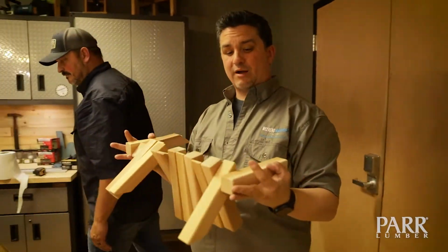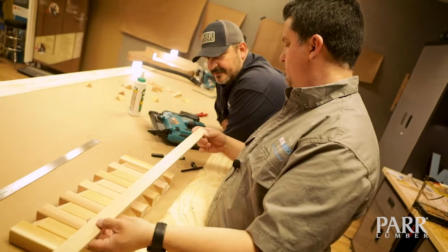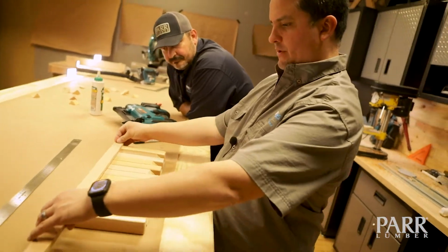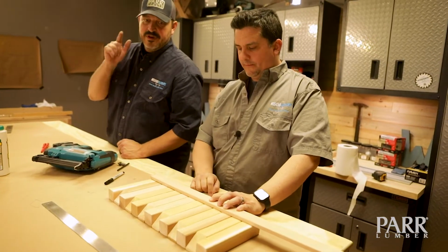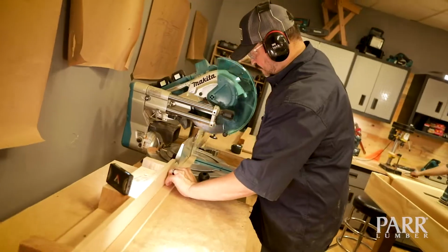I think we're going to have to add a couple strips to the back. We came prepared though. We bought this. It's bullnose stop. Yeah, just bullnose stop. So we're going to cut a piece to length here, and then we're going to fasten it and glue it to the bottom, and fasten it and glue it to the top. Pull those pegs forward and fire a fastener right into the... Cut that, clean that length off there.